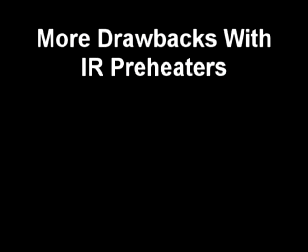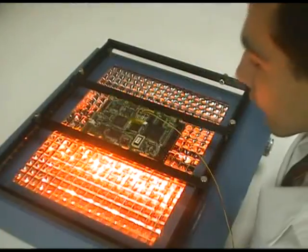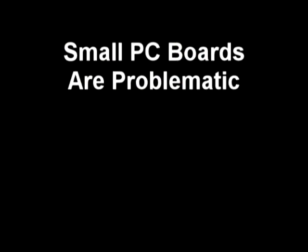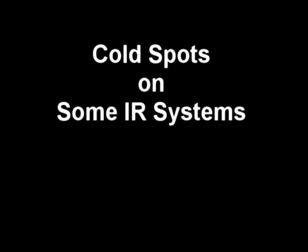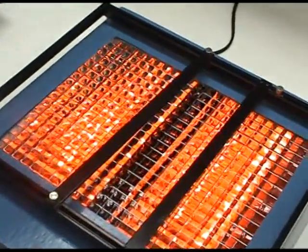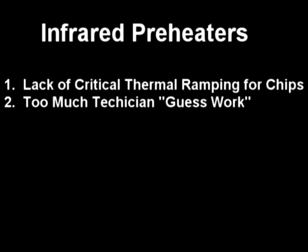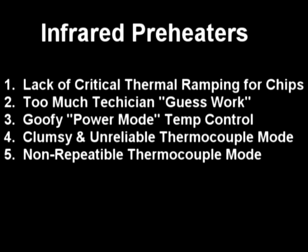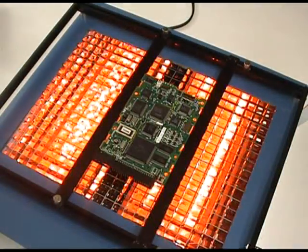Other drawbacks of infrared preheaters include eye strain fatigue from the intense glare of the IR source. Even a few minutes of IR glare can cause discomfort to the technician's eyes. And if your PC board happens to be small, the heat generated from these large IR heating grids is most unpleasant. Many infrared preheaters also have problematic cold zones right in the middle of the heating grid, where one would naturally wish to center the PC board. In review, IR preheaters can lack critical thermal ramping, require too much technician guesswork, utilize goofy power modes or do-it-yourself thermocouples that are very difficult to repeat, and can have cold zones in the middle of the grid.